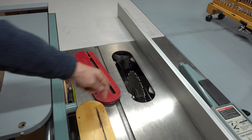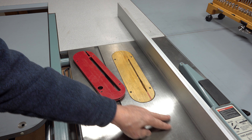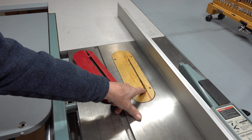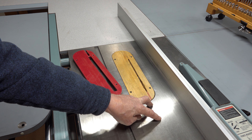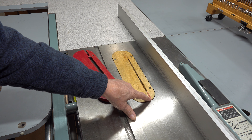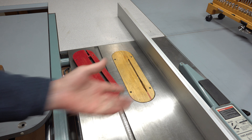This is a pretty simple thing to make. I also added this on front, which is pretty handy. Just raise your blade up and put a scale on either side of your blade and give yourself a couple of dimensions. A nice fine black line on either side of the red was done with a real fine micro Sharpie. That way, when you take a piece of wood with a little mark on it, you can move your wood up right until the edge of the black line and find out where you're going to cut without moving into the danger zone of the blade. This gives you a good start of where you're going to be right away.